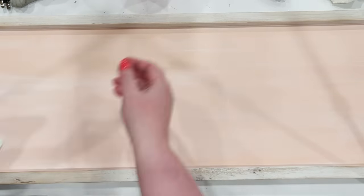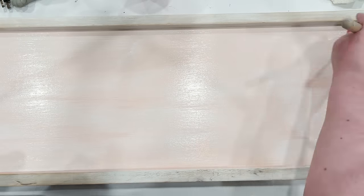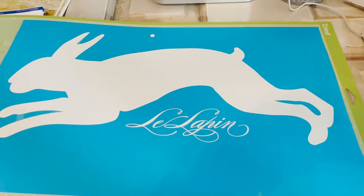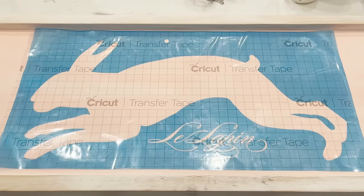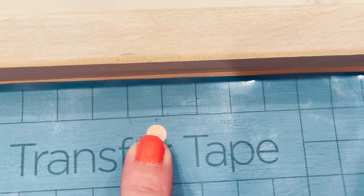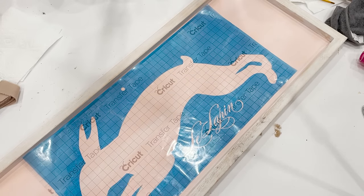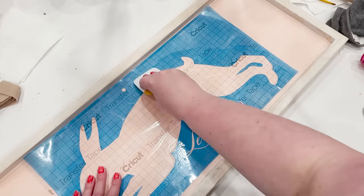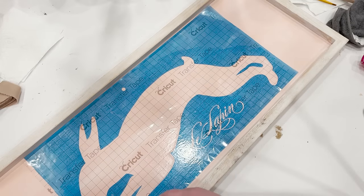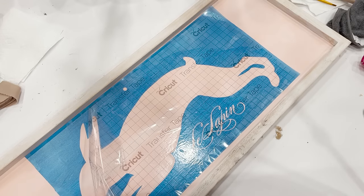I mixed some white chalk paint and a little water and I'm just brushing it on and then gently wiping it back off. For the art I decided to do, I drew it up in Adobe Illustrator and then input it into Cricut Design Space and used my Cricut to cut out my stencil. Once I had my stencil, I used transfer tape and laid it down onto my artwork. I actually had a hole cut with my Cricut so that I could line it up to the center of my piece of wood. You want to make sure you adhere the vinyl stencil to your wood really well, especially around all the outside edges so that your paint does not seep under your stencil.